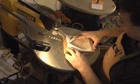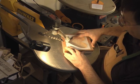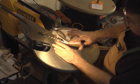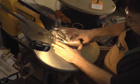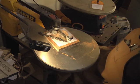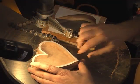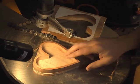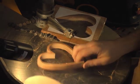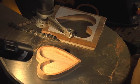I'm going to go ahead and cut the outer wall of the box. There, we've finished the cut. I'm going to go ahead and remove this blade and take the pieces apart to see what we've got. I've pulled the pieces out of the scrap wood — go ahead and remove the pattern. You can see what we have is the exterior walls of the box, and we've got the bottom and the top already cut. They ought to be a pretty good match so when we glue them together we won't have a lot of sanding to do. I'll meet you back over at the workbench and we'll start to put this together.